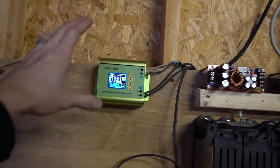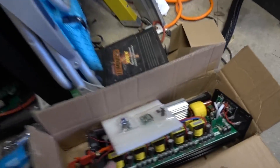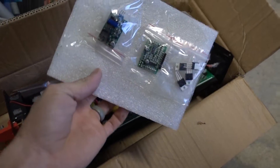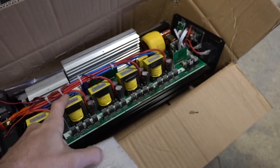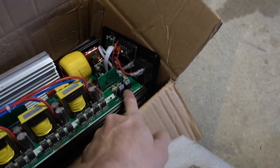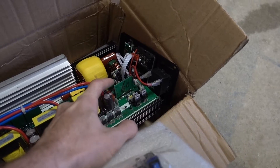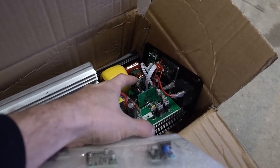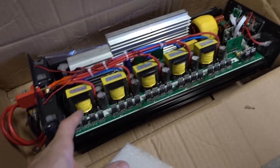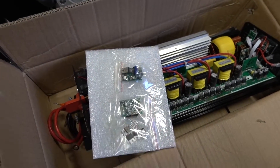That's what I got new, and one other thing came in the mail that I'm very excited about — I'll be installing this later. These are the parts I ordered for this inverter. They sent me all four new resistors or whatever these are, a new 60 volt control board, and whatever this other board is. So I'll be desoldering those. I already got all the new MOSFETs in, and I'll be putting these in — hopefully it works.